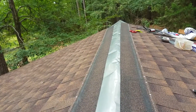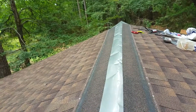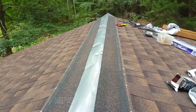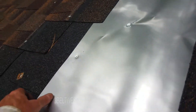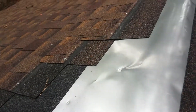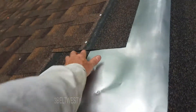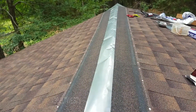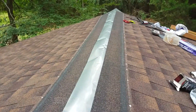Need to put one more course of shingles and then cut back and also cut the gap for the garage ventilation. Here's the aluminum nails — this aluminum is for the ground plane. That was a galvanized nail over there. I'm using aluminum nails when I get up into the aluminum area, just because I worry about corrosion. I've done galvanized in valleys before, but I figure why tempt fate — just use aluminum underneath the aluminum.